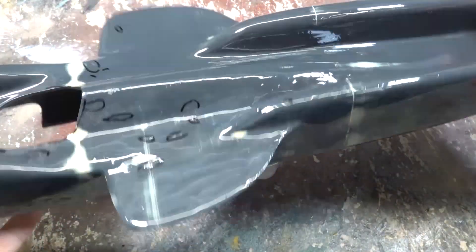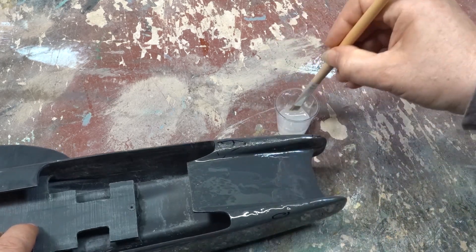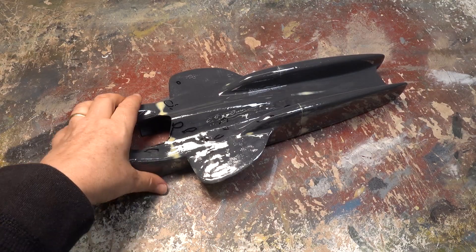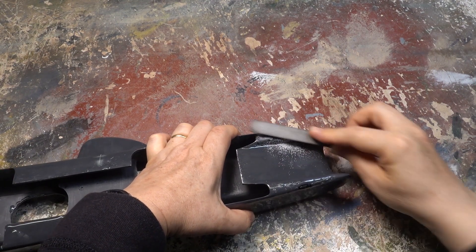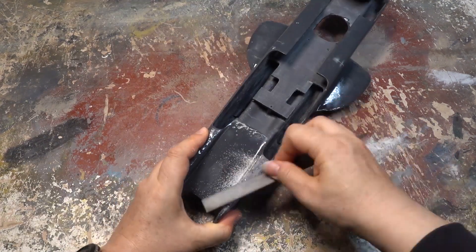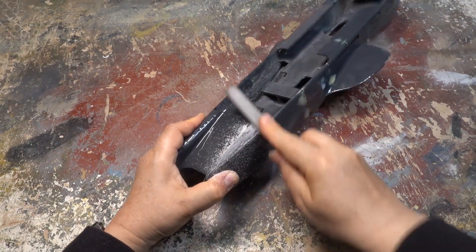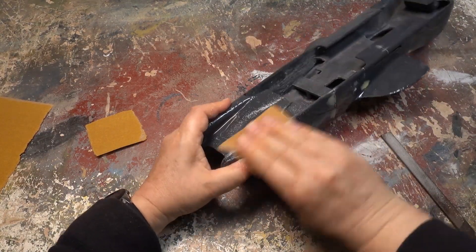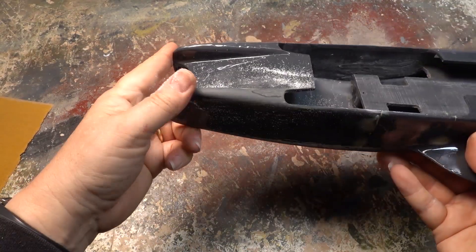After some careful inspection I used a marker pen to show me where I needed more epoxy and went around retouching. This went fine with the second coat bonding well with the first. The XTC 3D gave a really hard finish which meant I could get a good smooth surface with some sanding. The next stage was to break out the elbow grease and sand down any runs, generally smoothing out the entire surface of the T80. This all took a very long time, constantly filling, filing and sanding over and over again to try and get a finish good enough for paint. So I didn't go completely mad, I made a start on the cockpit.